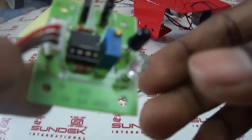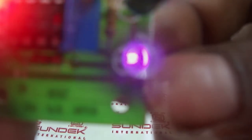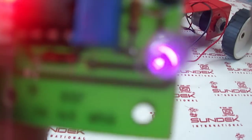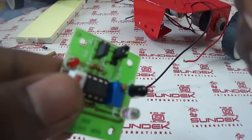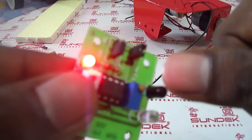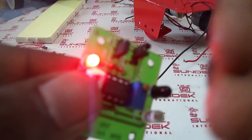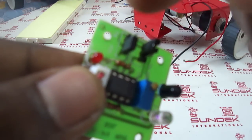Let's see how the sensor works. This is an IR LED. You can see the visible light with the help of a camera. These IR rays are not visible to the human eye, but you can see the violet rays indicating that the LED is emitting IR rays. This is the photodiode or IR receiver. When there is no obstacle, the IR rays are not reflecting back, so the receiver gets no signal. Whenever there is an obstacle, the IR rays are emitted back and the receiver starts to receive the rays and gives an output.